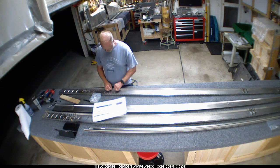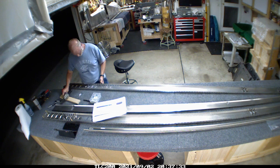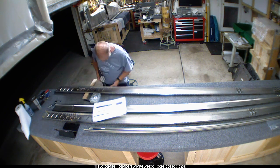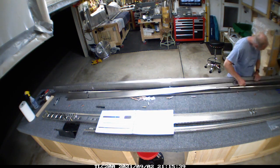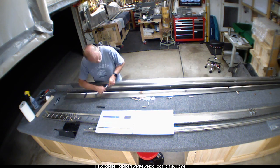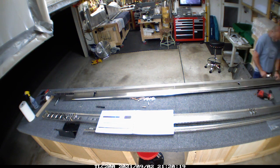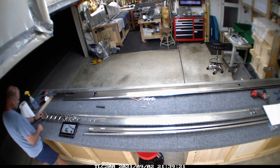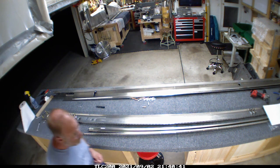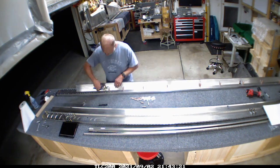They basically mirror each other, so it's right and left. I spent some time working on getting those parts cleaned up and getting the rivets done. There are definitely some rivets you don't want to put in at this stage, so it's a lot of thinking through next steps and only riveting what needs to be done now — otherwise you wind up going back and drilling a bunch of them out.